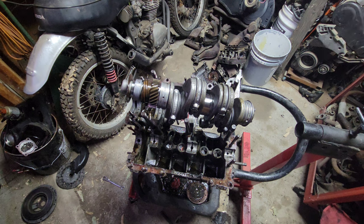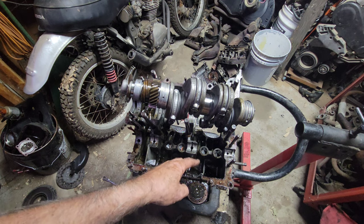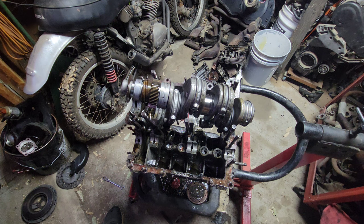Mystery a little bit, but there's no way to know for sure that the cam was the issue. This is the second time this engine did this. Originally I thought it was the oil pickup had lifted, and then we just went through it real quick and did a quick cheapy rebuild, and didn't line bore it, didn't get the cam bores. Should have got those things done probably, and it would have lasted. That's what I'm thinking now.